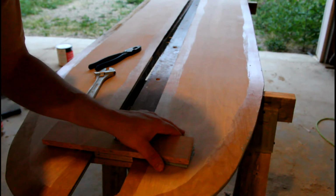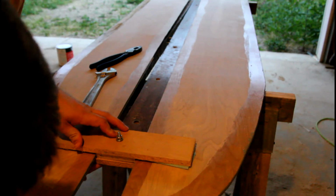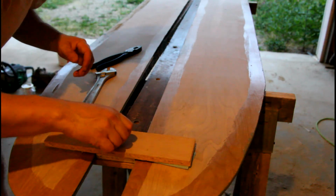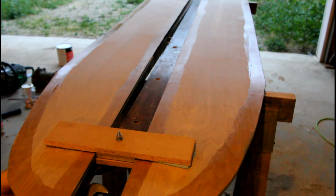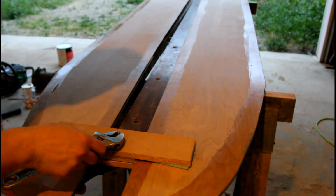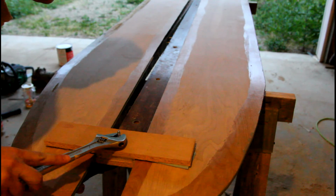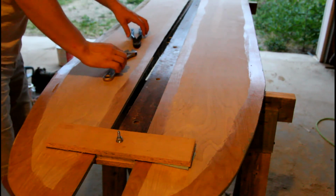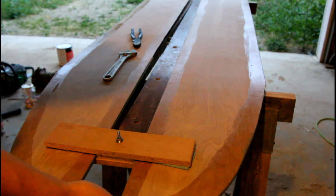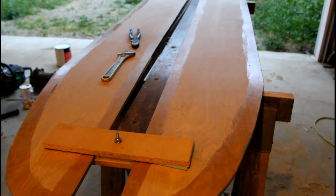Slide it down just a bit. Make sure it's back together with that spacer at exactly 3.5 inches. That dimension comes from the internal spreaders that we put later. The spreader design is based upon this gap being 3.5 inches max. It tries to push everything out to that line. So anyways, this spreader's in. Front's even. That side's good to go. We'll come around to this other side here and do this one.